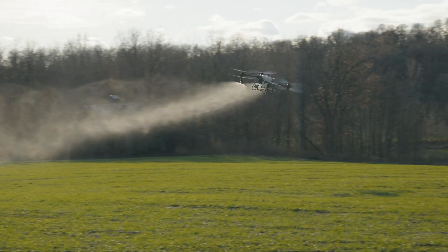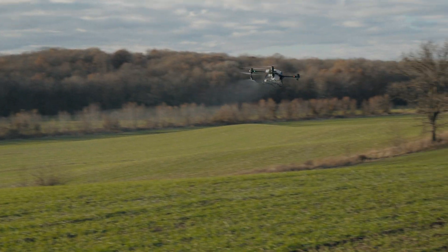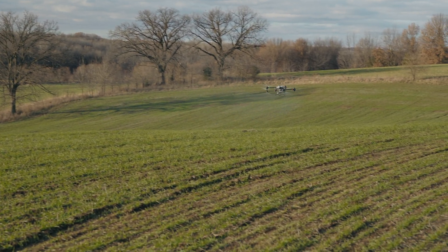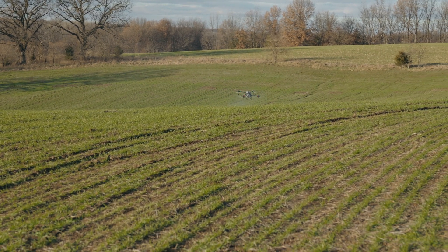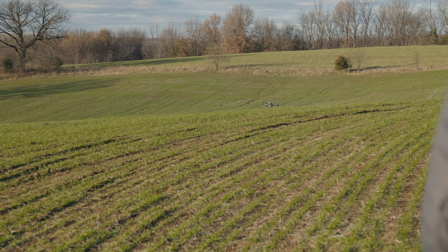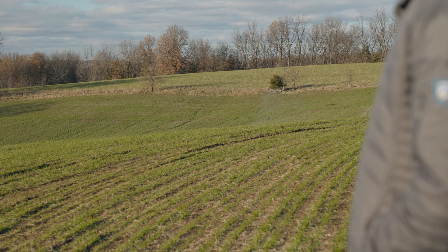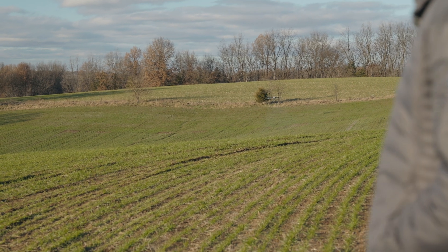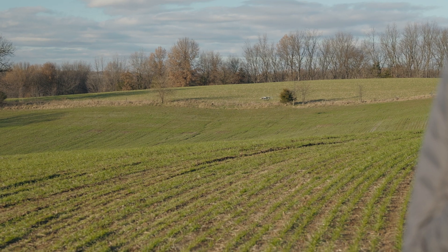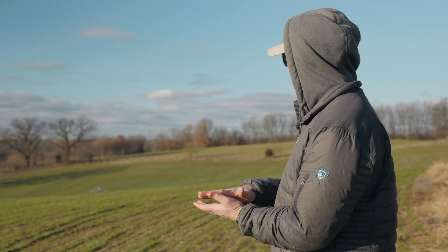That's really critical for small fields like this where you have lots of turns — getting that drone turned back around and back up to speed is critical. There again it's dropping down, stuttering, getting really low to the ground. It has not braked just yet, but our height is all over the place — 22 feet difference from top to bottom, because it's getting so low.